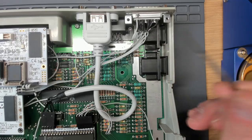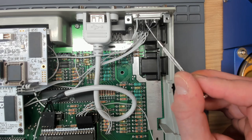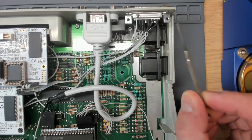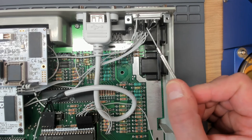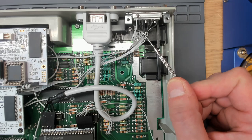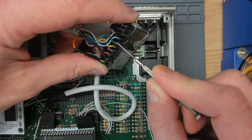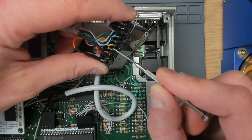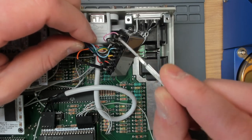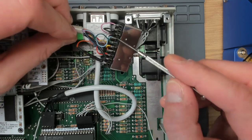Going around the board, starting at the top right: I've completely rewired this DB15 RGB connector and made a correction. In the previous video, the on-screen display on my monitor didn't recognize that a SCART cable was connected - it was grayed out, cable detect wasn't working. On the SCART end, you've got grounds for the RGB signals, an audio ground between the two audio channels on top - that audio ground wasn't connected, so I've jumped it from one of the other grounds, since the Atari has no provision for individual RGB grounds.